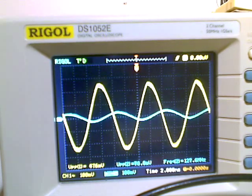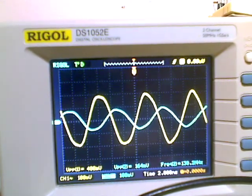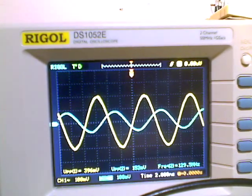Nice proof of concept. You can see that it acts as a very nice high-pass filter. It is about the corner frequency there — around 130 MHz is where it starts to dip off.